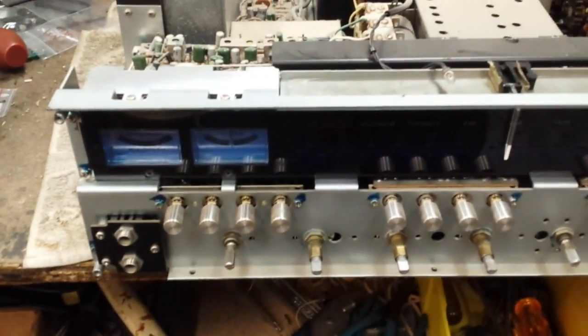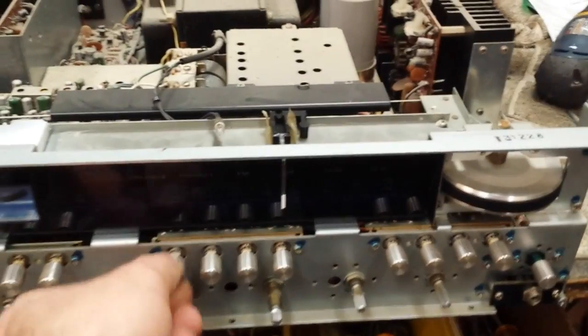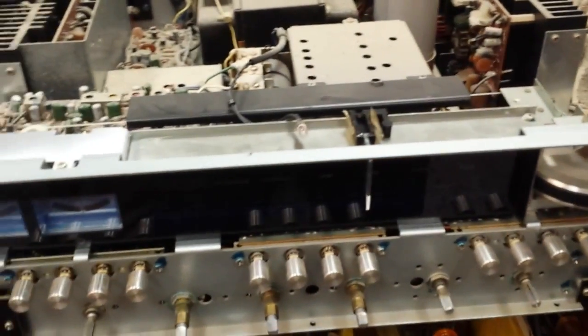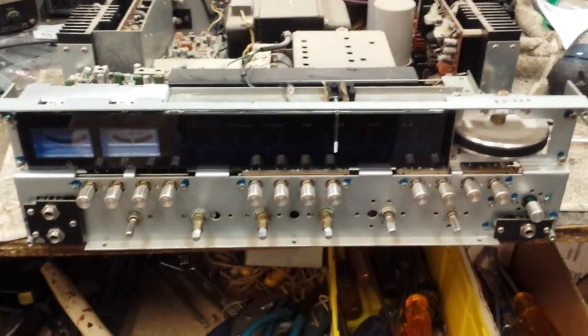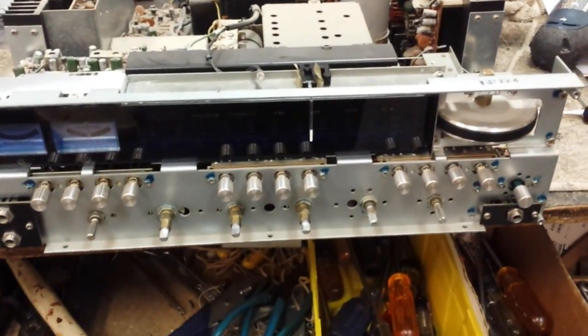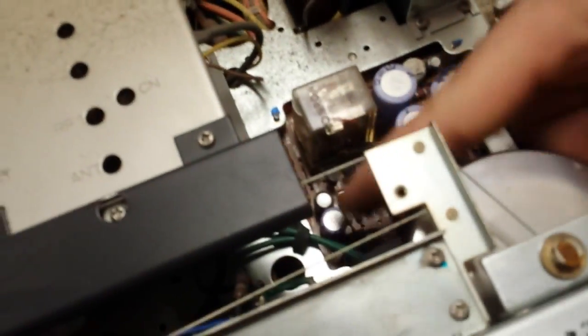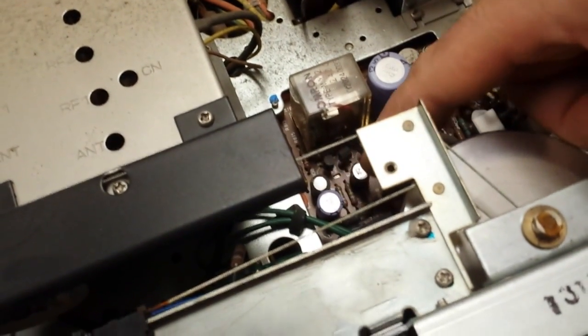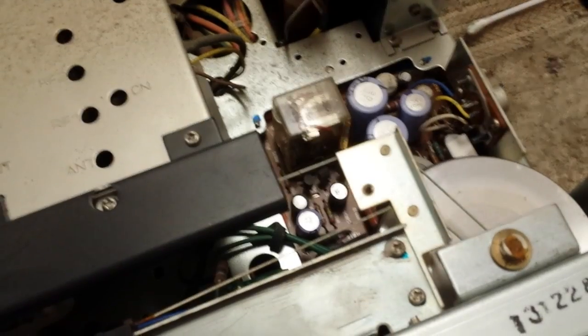Now, if you want to, you can try to remove these button caps. I don't really recommend it because the plastic shafts on the switches are brittle and tend to break. The way that I recommend you pursue this is you start by chemically treating all your switches and controls, deal with a problem in the power supply regulator and protection circuit, and usually that deals with the timing capacitors and drive circuit for the relay. These capacitors get open and it will take a long time for it to come out of protect.